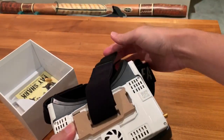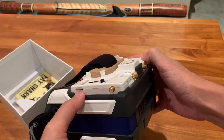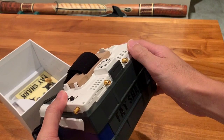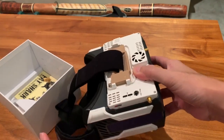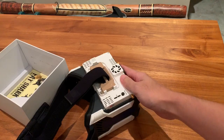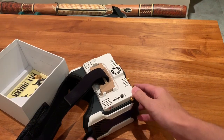The other thing required is to flash the ByteFrost ground station with the latest firmware, so that you have an option in the menu to flip the screen inverted. The reason for that is the Transformer has a pair of mirrors inside, and you do need to flip the source image for you to see the image upright through the viewfinders.